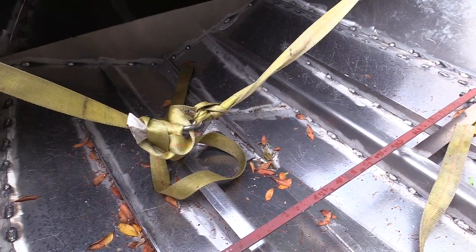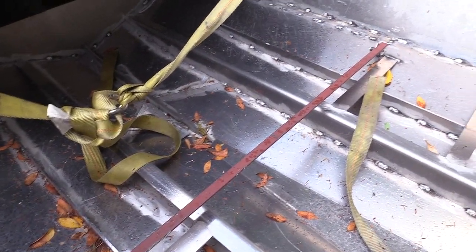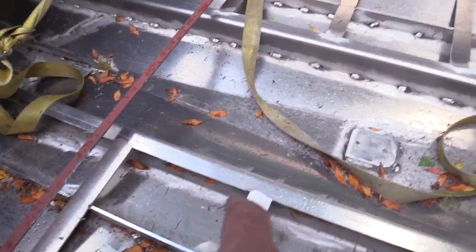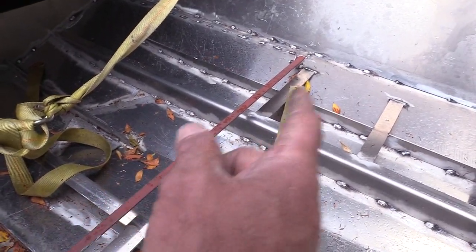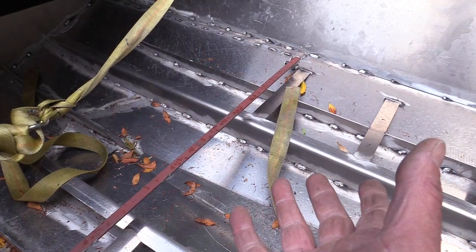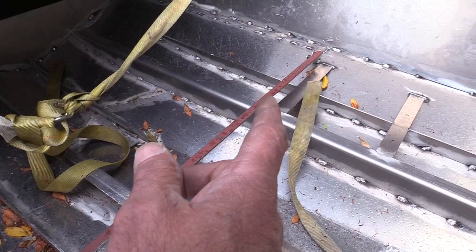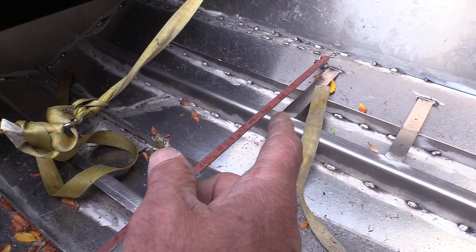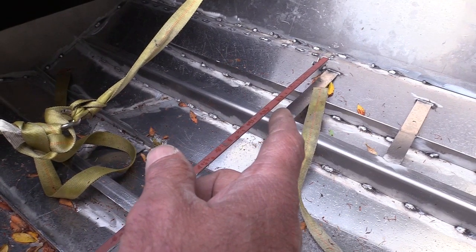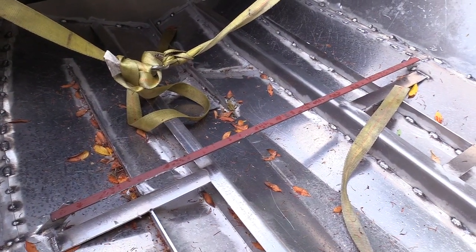So when you're putting this together, you've got your flat bar on the bottom that sets the angle, and before you put these engine bearers in, the instructions say to put that crossbar in. Measure the width. Okay, so you've got it blocked up, you've got your crossbar in, your width is right. Well, that doesn't set the height of each side. You're just blocked up evenly on four blocks. Okay, your height difference starts there. That's where that comes from.